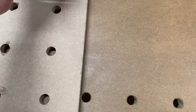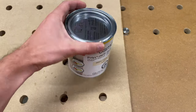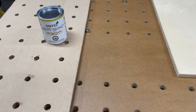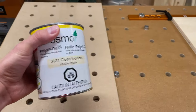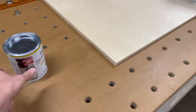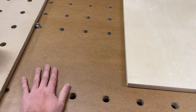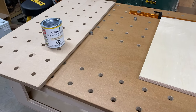You'll see it's a little more brown. What I used was Osmo Polyx Oil — I've never used an Osmo product before. This is the 3031 Clear in matte finish. I was looking at using polyurethane and read a lot about how people finish their MDF MFTs, and it was all over the place. The advice I got from my wife was: you put so much time into this table, why not use something good? Osmo's not cheap — 750 milliliters was $70 Canadian, and I used about half. I did three coats on the main top and three coats on the auxiliary piece. It went on really nicely and pieces move around pretty freely but it's not too slippery — exactly the finish I was hoping for.